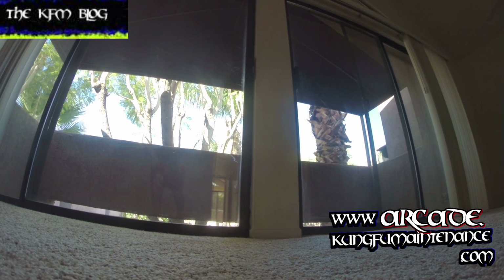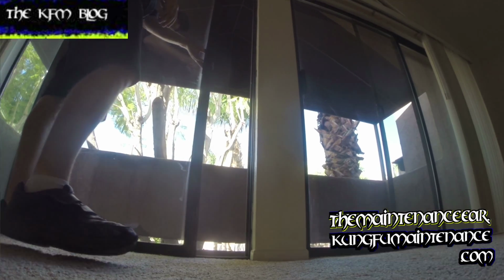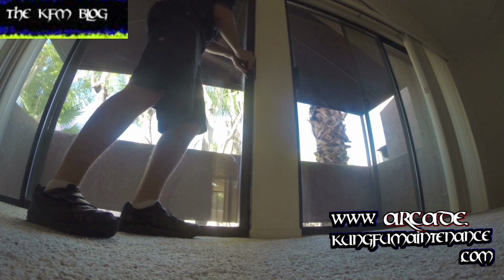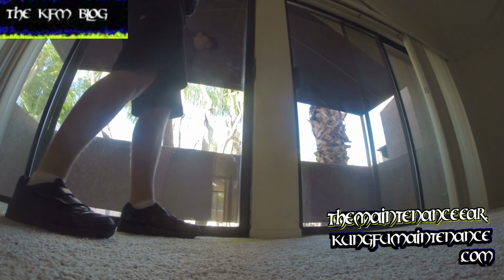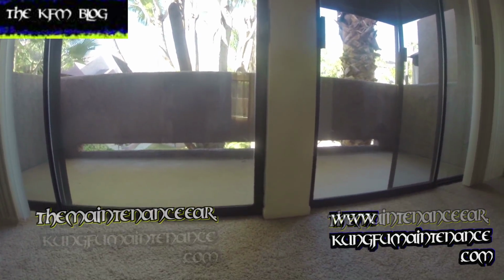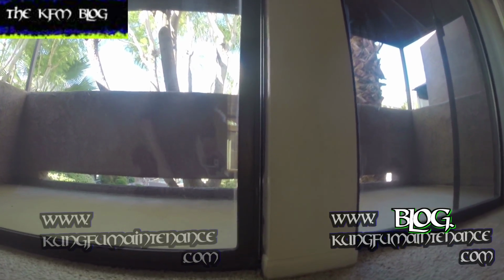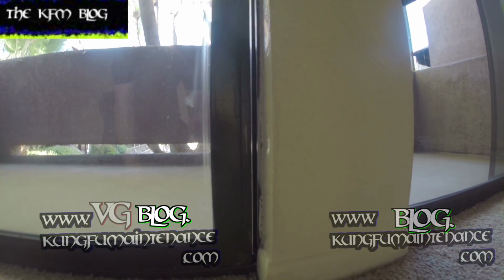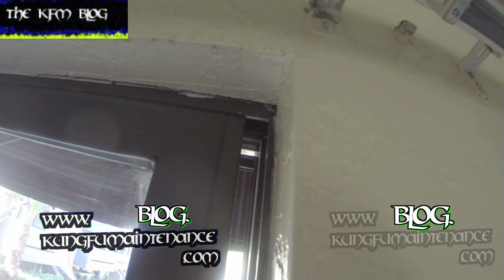Okay, I got a dining room patio door here that's really tough to close. Now, if I push it really hard, I can get it to close. But what's going on there is the pivot is a little bit off, and the bottom is hitting before the top. You can probably see it a little bit more from this distance. The gap here is about a 1/4 inch, and when you get to the top, it's about 3/4 of an inch.